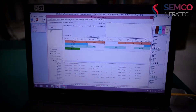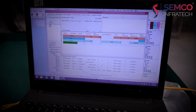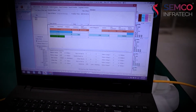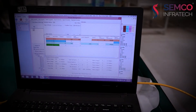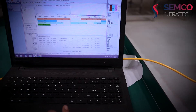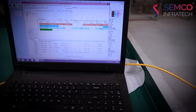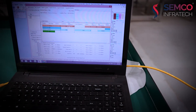This is the first step — constant current, constant voltage charging. Since this cell is LFP, we are giving an upper voltage of 3650mV. Generally, we charge the cell at a 0.5C rating. For the cylindrical cell, since the cell is 15Ah, we have given 7500mA for the current. The second step is rest, the third step is discharge, the fourth step is rest, and the fifth step is again constant current, constant voltage charging up to nominal voltage.